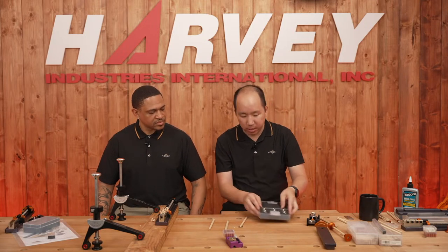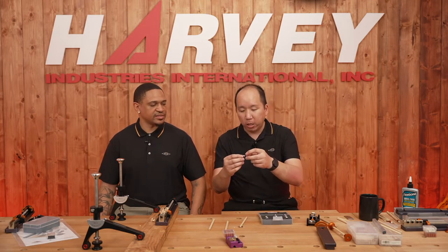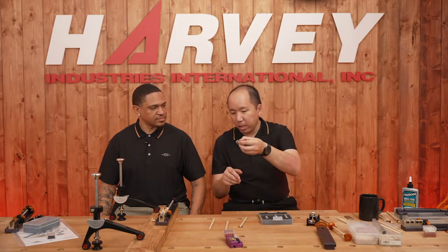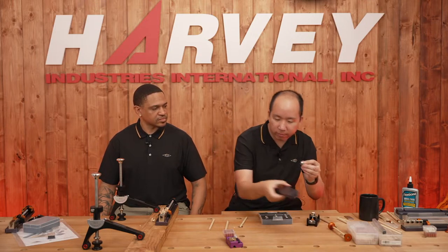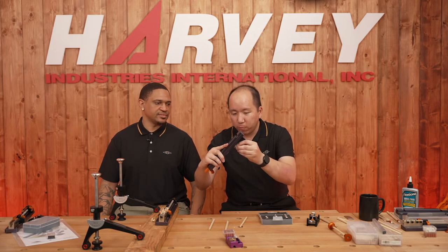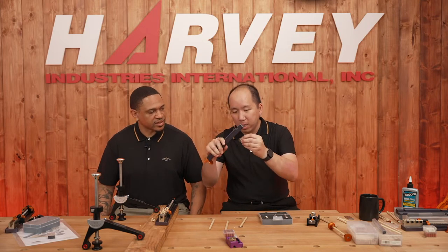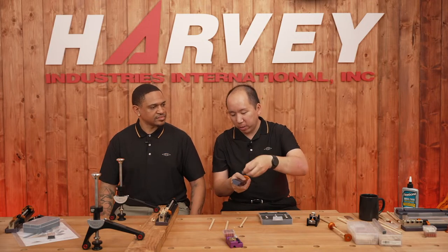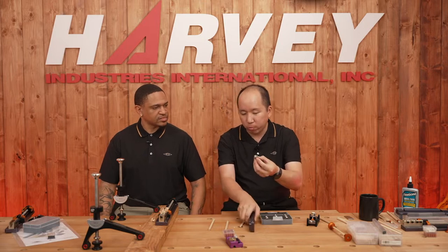If we're sharpening the dies, use a drill that has a half inch chuck. Grab the rounded side onto the chuck, like so. Again, with the drill running, if this is my sharpening stone, I'll match the bevel, so the shape of this cone. I'll rest my sharpening stone on it and just have it run. Basically you'll be reshaping or just putting a sharp edge on this right here, just to keep it nice and sharp.